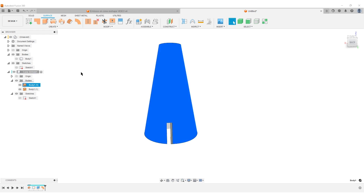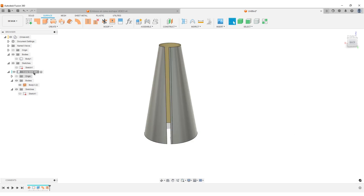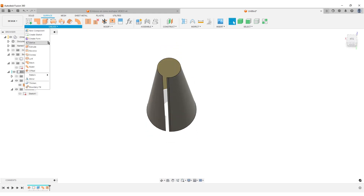You can see the body turns white — I'm not sure if that's a bug in my software, but it's a different discussion. Hold down Ctrl, select both bodies, and do a Stitch. Hit OK and we now end up with one single surface body.